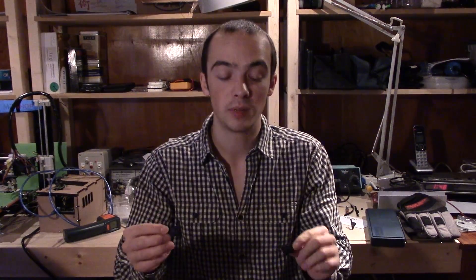Luckily I have two pieces — they're both concave, except you flip it over and it's convex. On the other acrylic plate I actually have it taped on the convex side, I might try that another time. But as far as I'm concerned, I can still print on the corners just fine. This is how I printed these guys — I was printing on the corners where it was optimal height between the extruder and the acrylic plate. So I'm going to try printing a larger piece in the corner, just like I've been doing, except it's a larger piece. Let's get right into it.